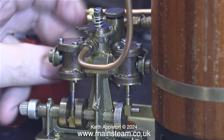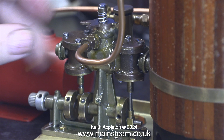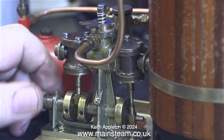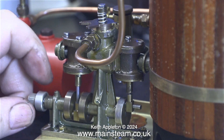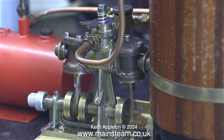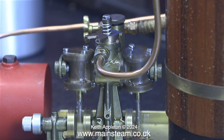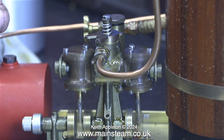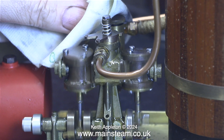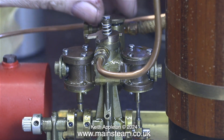The engine will not start straight away. The first steam into the cold engine condenses the water immediately and it starts to hydraulic lock, which is not very serious on an oscillating cylinder type of engine because the parts just move out of the way. The engine cylinders soon get hot and it starts to run quite well from the outset. There is still a bit of condensing going on, and the exhaust goes straight up the chimney along with the oil residue, which then drips down inside the chimney onto the boiler and makes a sound like a fish and chip shop.